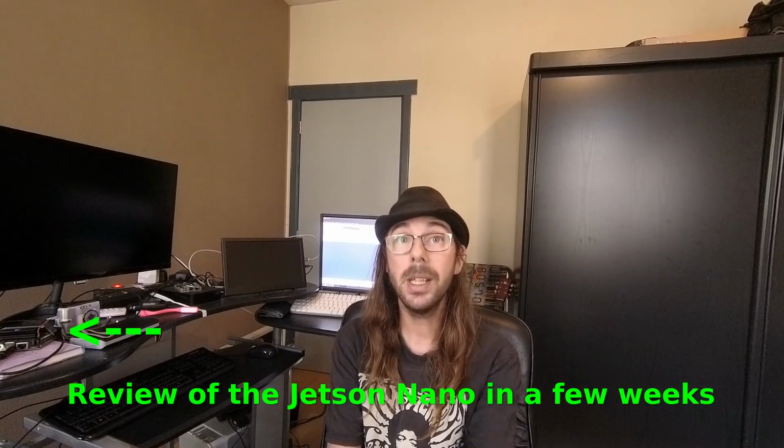Until now I was mostly using Samsung Evo Plus SD cards. I was used to it, they last for a long time, I've never had one fail, so I kept on buying these. These work great with most SBCs, but the SD card readers of SBCs are mostly very slow. The fastest SD card reader of an SBC until now was the NanoPi M4, which could do 70 megabytes reads and also 70 megabytes writes, of course. But this cannot do 70 megabytes writes, so this is actually slow in the write speed while the read speeds are very good.